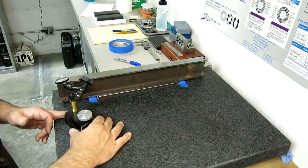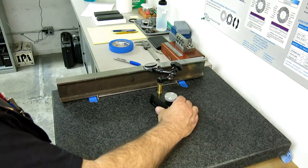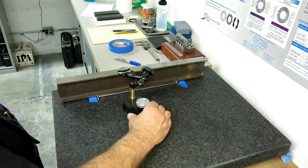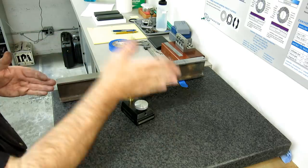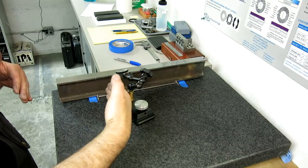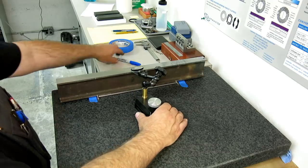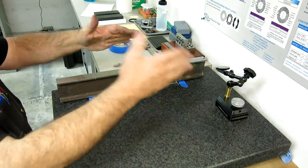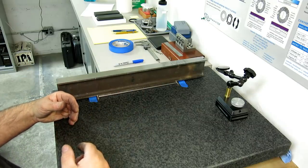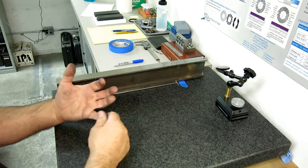I'll zero it at one end and then traverse along and check it in increments across to make sure it's flat this way and flat that way — parallel to the surface plate. Then I mark it with a Sharpie and take it over to the lapping bench. I don't do any lapping in here — this is all my fancy-pants measuring stuff in here. But we'll go look at the laps I made. This is peculiar because it's soft, and it didn't even click to me. Robin Renzetti and I were talking and he said, yeah, you should use an aluminum lap on that.